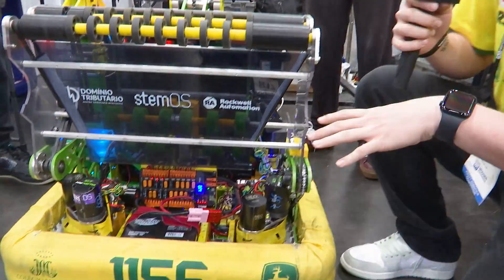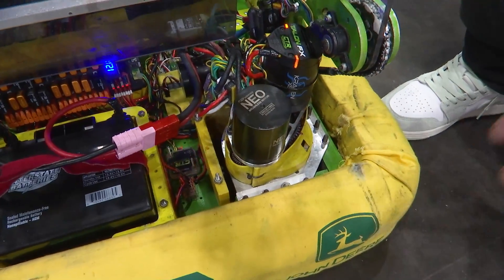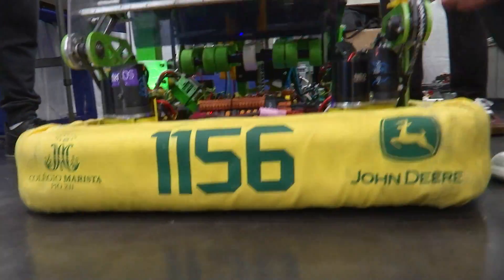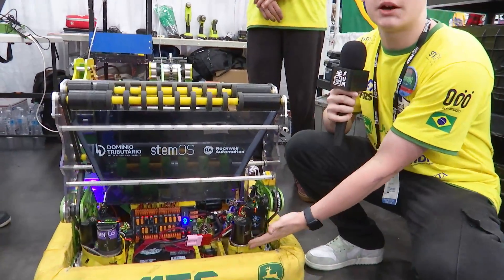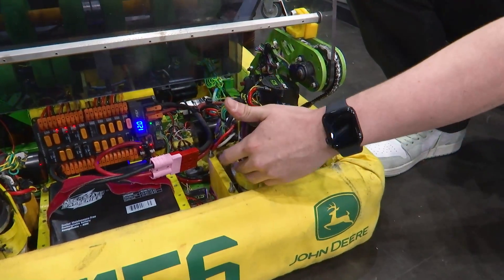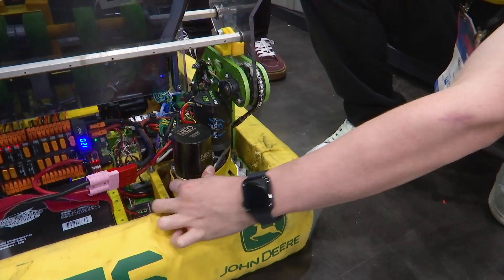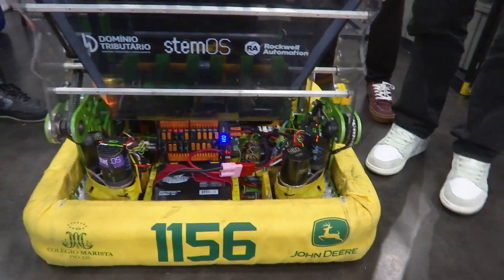Another cool design modification we made is this little tube right here that is one inch wide, so the robot sits only 0.6 inches from the ground - it's really low, as you can see. Also, since the robot is very small, we did a lot of things to improve the electrical layout. We have 3D printed parts that improve the SPARK mounting - the SPARKs are mounted on this 3D printed support, which also protects the gears of the SDS swerve drives and allows us to lubricate and do all maintenance easily. We just pull this piece out to remove extra grease.